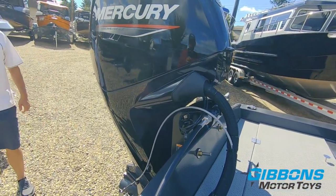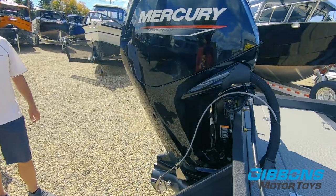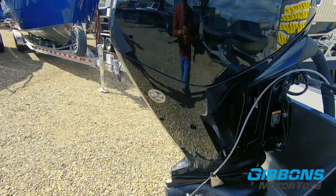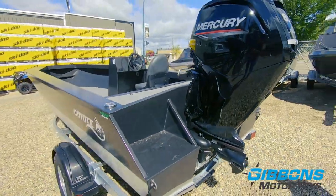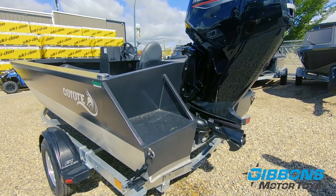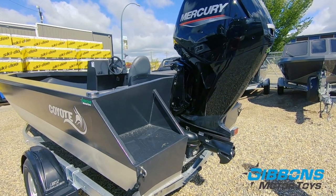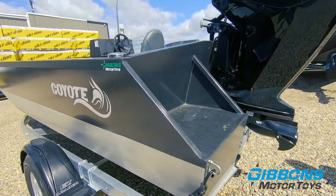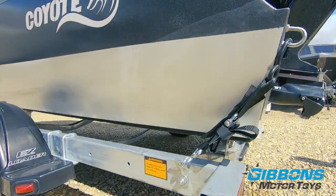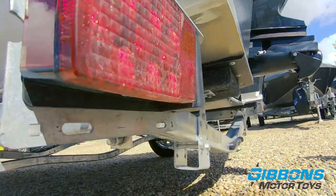There are always arguments about hull degree — the shallower the hull bottom, the shallower the water you can run in, but remember there are always compromises. This 10 degree bottom is what works best with the least amount of compromise in most applications, particularly when running shallow water and river running.